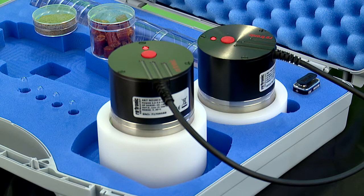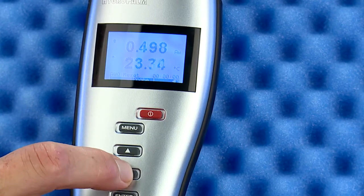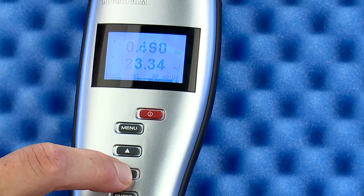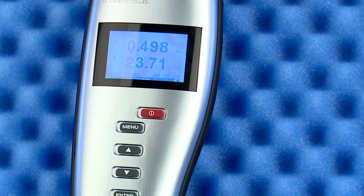As you can see from the instrument setup, two probes can be connected to the HP23 at the same time. Switching the display between the two probes is as simple as pressing the Up or Down button. When using two probes and performing AW measurements, starting a test starts both probes at the same time, so make sure to have both samples ready.